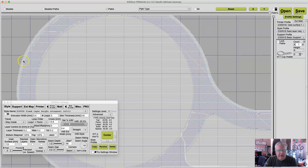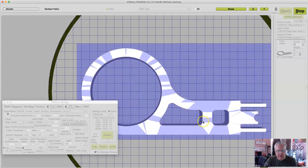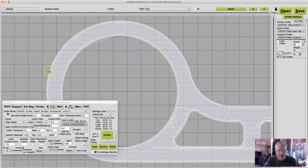Let's take a look at what Group does. I'll re-slice and zoom in. Now you can see quite clearly the difference. In the Group case, KISS constrains the paths to just go over the printed part and avoids going over the large through-feature — in this case the large donut hole where the cup goes. Why choose one over the other? I've only been using the feature for about a week, but I've printed close to 20 parts using it. I found that Sweep — the continuous path across the entire part — gives a slightly better top surface, with less artifacts around the edges and a bit smoother.